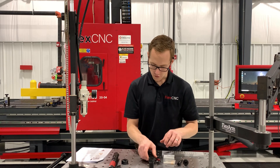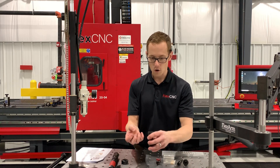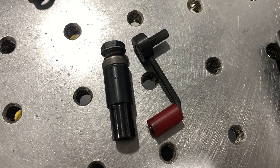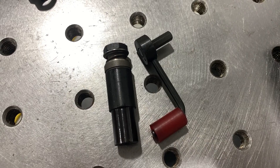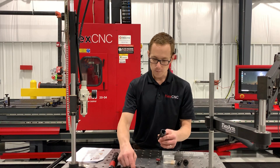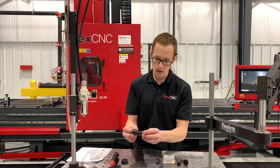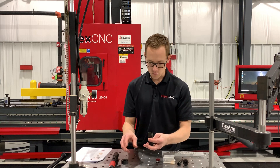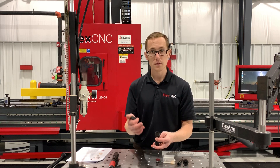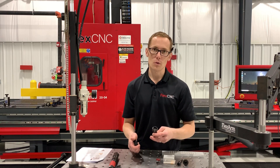The other component I'll show you is a friction clutch. The friction clutch is used with the small adapter for your small helicoils — anything from 2-56 to 4-40 is where I recommend the friction clutch. In the small adapter, we pull out the stock insert and put in the friction clutch. This is going to help us with those smaller holes to limit the torque and stop us from damaging our front end assembly or the threads that we're repairing.